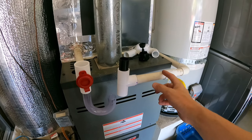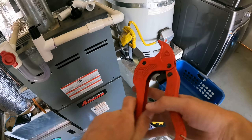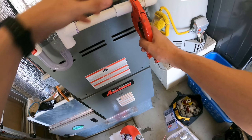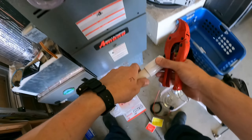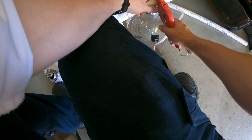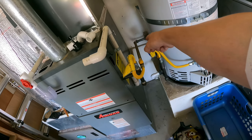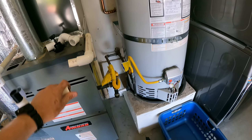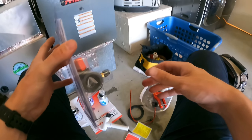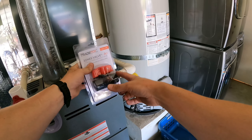I'll need a little bit of room there but I'm going to cut this out and do my blowout valve right here, so it should work out. You can see a ton of junk inside that line. When placing the blowout valve, I could realistically do it anywhere, but it'd be much easier further over. With all these elbows here, I want that blowout valve to be before as much of that as possible, just to clear out those lines. I may have to add more PVC or another coupling, but I don't know yet how it's going to fit, so I'm going to hook this up directly to here.